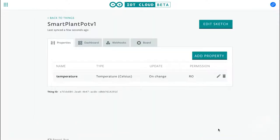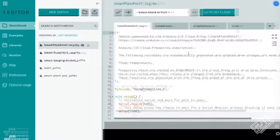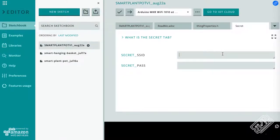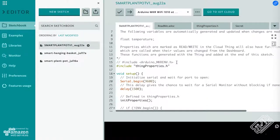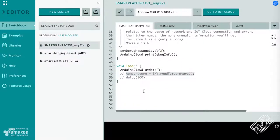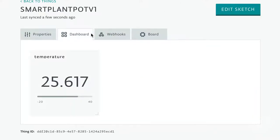Click add and it's there. Click on the button saying edit sketch and you'll see the familiar Arduino editor. Now if you add your own WiFi details into the secrets tab, and then in your Arduino sketch, add the Arduino environment shield library. In the setup, begin the connection to the environment shield and make a temperature measurement. In the loop function, make a measurement and then delay for 200 milliseconds. Finally, upload your code. By going back into the IoT cloud and clicking on dashboard, you'll see a live measurement if it all works.